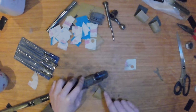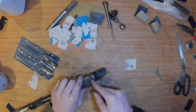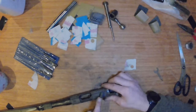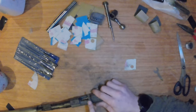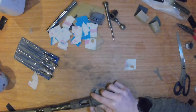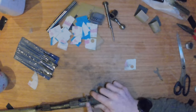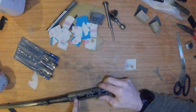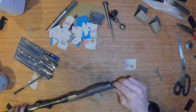The bolt carrier is probably the worst part of the rifle for machining marks. Sandpaper simply wouldn't remove these, so I just got a needle file and carefully went over almost the entire area until those marks were pretty much removed. Obviously I only did this to the outside of it and took care not to go anywhere near the sight mounts. All the markings are still left intact — like the serial number, made in Czechoslovakia, etc. — but they then became quite smooth to the touch.